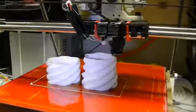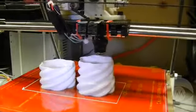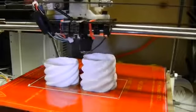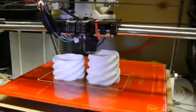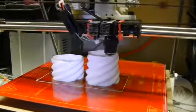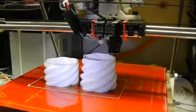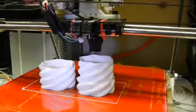When we have a 3D object model in an STL file, we use a program that virtually slices it into layers. The program I use is called SkeinForge, and it slices or skeins the model into layers. When it's done, the result is a G-code file that can be sent directly to the printer's controller. There are several G-code programs, and some host software programs have one built in, but most people in the community consider SkeinForge to be the most advanced free program available.